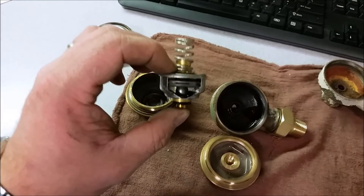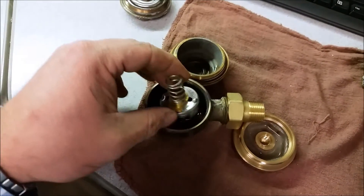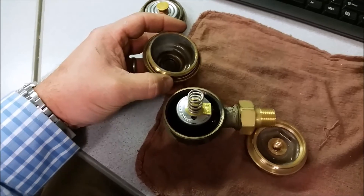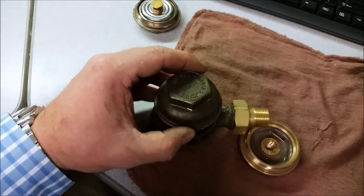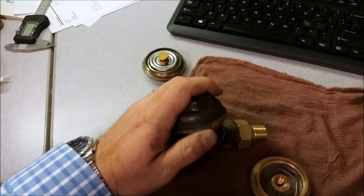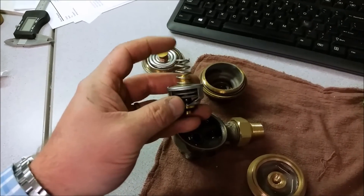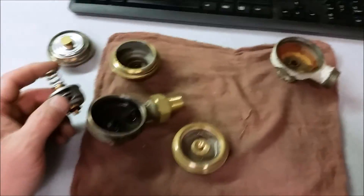So all we have to do is fit this cage unit — the seat is calibrated to the orifice size — fit that in there. Some covers can have trickier sealing surfaces to mate to, but this has not been one we've experienced issues with. That's a 1950 cover; it just screws down, and that's the spring pressure we have on that. You saw how fast our cage units react, because the distance between the plug and the seat is calibrated in the factory and it's the same for all cage units — that's why ours sealed up so quickly. And that's a primer on a Dunham 1, 1E, 1A, B seat — they're all the same basic premise. Any questions, give us a call.